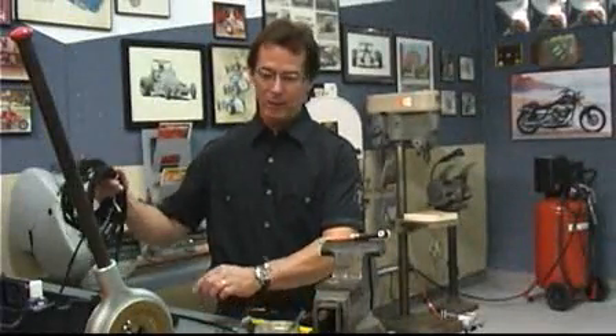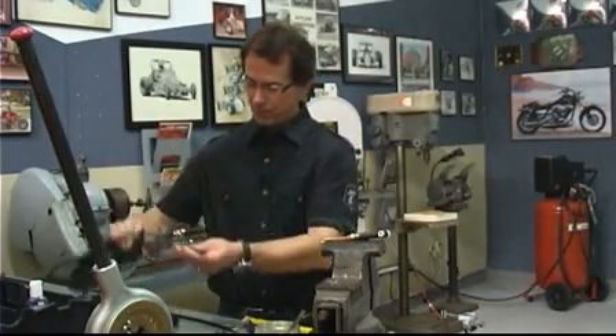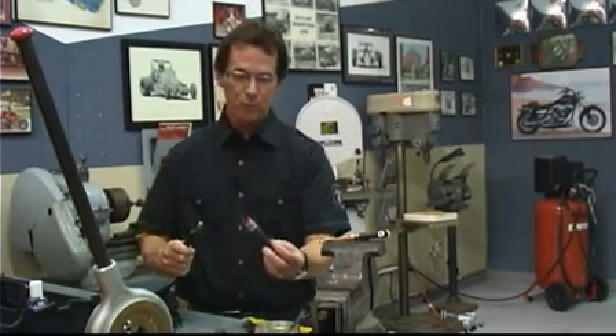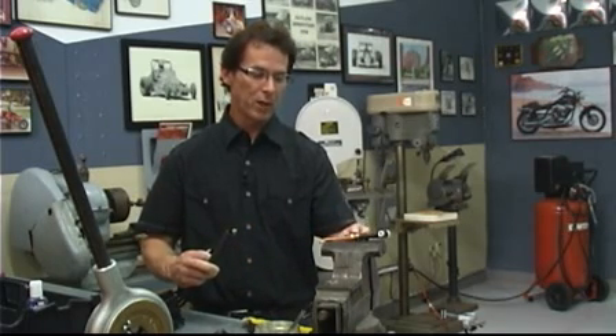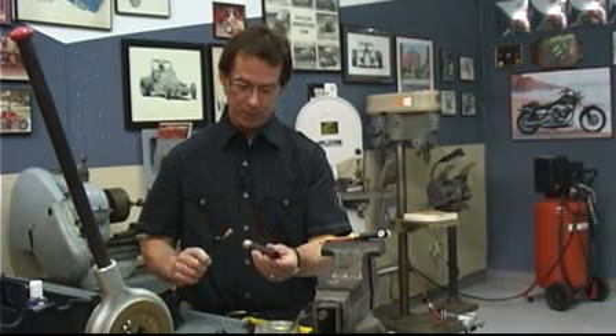I have the power cable, water and gas hoses, and I like to pull a little bit of the lead out, stack them up so they're easily accessible, then bundle them so you can push them through the handle assembly. Make sure before you get too far that you've got the right handle for the torch body. This is a threaded torch and if you look down inside the body of the handle, it has threads in it.